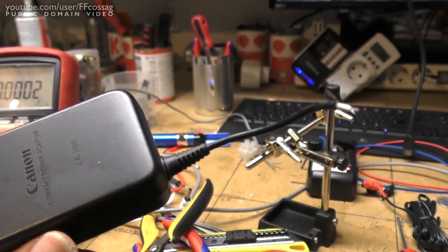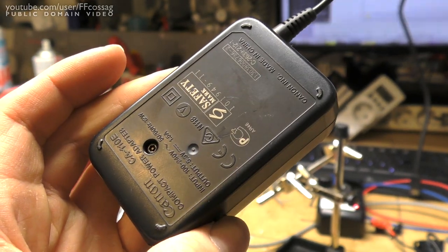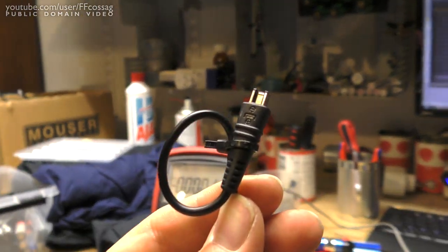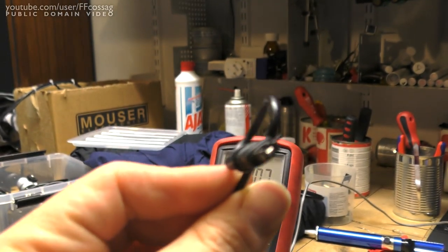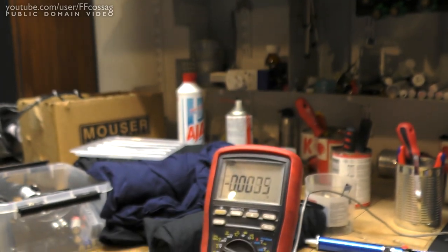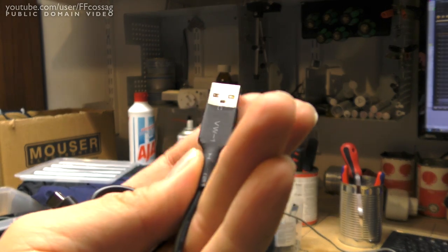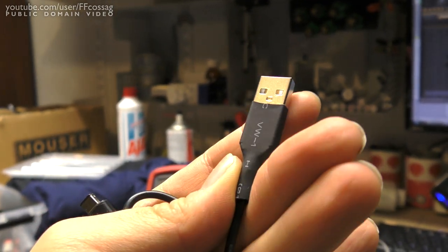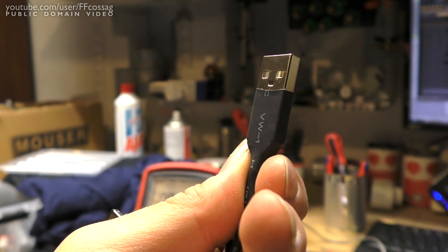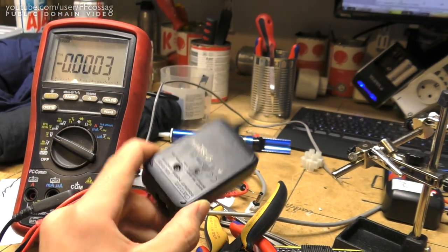While mass-producing camera adapters, I cut the cord for this evil Canon-branded thing - a 5-volt wall wart with a fixed connector going to this utterly evil camera charger lead, which is required to charge your battery since you don't actually get a proper charger with my cheaper Canon camera. I've mounted the other end to a USB plug. All that's going through this lead is 5 volts - there's no reason Canon couldn't have just used a standard DC plug and USB lead like Panasonic did, but nope - evil proprietary adapter hardwired into the power brick. Now it's remedied.